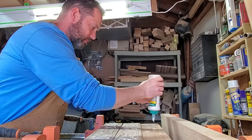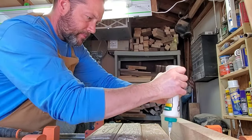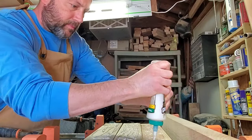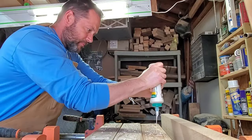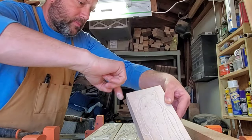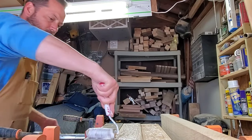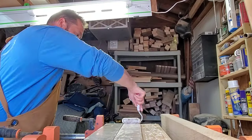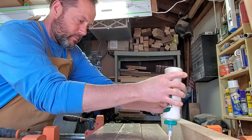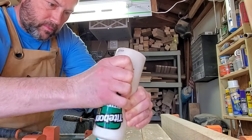Just glue up and clamp with nice even pressure. I like to use cabinet clamps on the bottom, and pipe clamps and bar clamps on the top, keeping everything nice and level, especially on the edges. If we have to, we throw some F-style clamps and cauls in so everything stays nicely jointed and not raised up at any uneven sections. That's also good practice. So we're just going to glue up and get these first three sections set up.